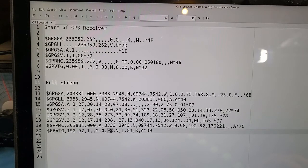The final message output from this receiver is GPVTG, which describes track and speed in greater detail — similar to GPRMC but giving heading, speed in knots, and speed in kilometers per hour. Other receivers will have more detailed or different messages; the order of messages isn't guaranteed either, so that's all part of the parsing. In my case I'm going to pluck off the time — that's the thing that's important to me — and create some code that does that parsing.